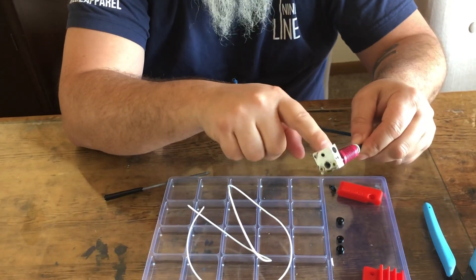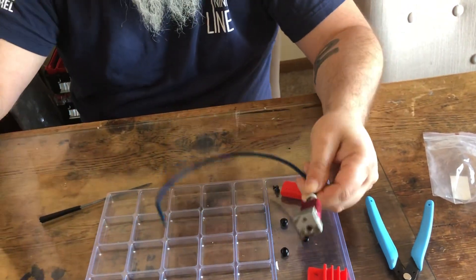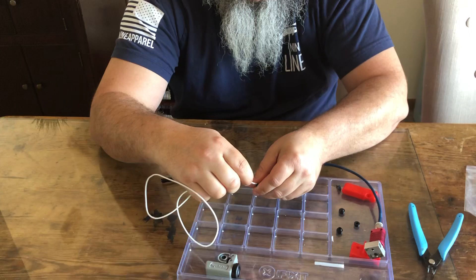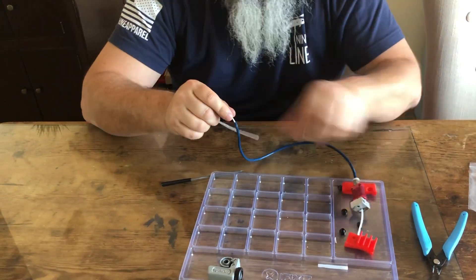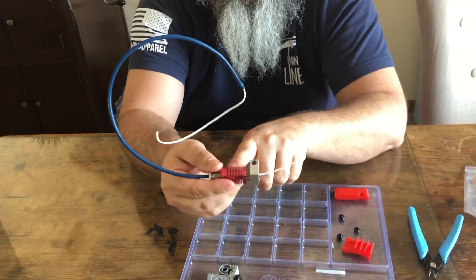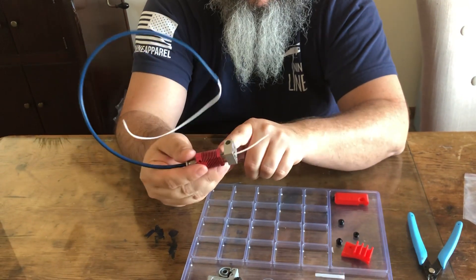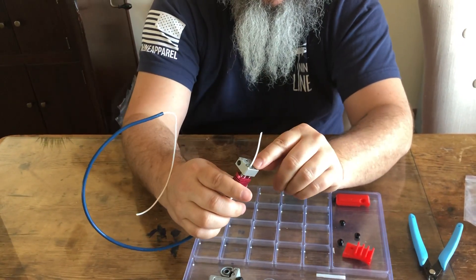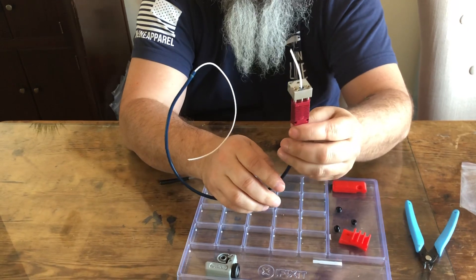This piece doesn't keep the tube from sliding left or right. I noticed in all the instruction videos that people would pass a little piece of filament through when aligning the washer with the bottom end of the hot end, then align it with the PTFE tubing and the coupler. You can see I just pushed that through with no effort. Some people have said this hot end is slightly off and their tubing is slightly different in length, so I'm trying to think of a smarter way to measure — where you'll put this in, tighten it down, and get a depth based on your nozzle threads. I haven't got that far yet, but I'm hoping this works out. Thanks for watching, peace.